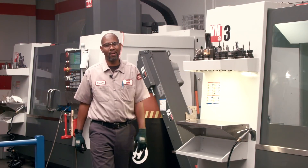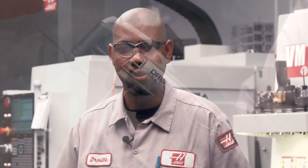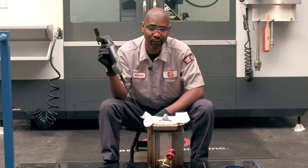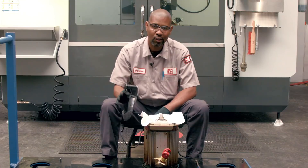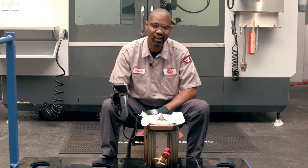There are several different methods to remove an encoder pulley from a spindle motor shaft. You can make a drill bushing and drill directly through it. You may be tempted to use a chisel and a hammer — that's not a good idea, as it will damage the motor bearings for sure. Instead, use a Dremel tool with a metal cutting blade. It's very simple and effective, available at a local hardware store for about a hundred dollars — compare that to bearing damage which will cost thousands.